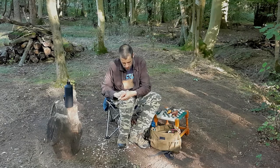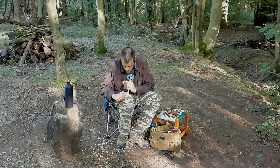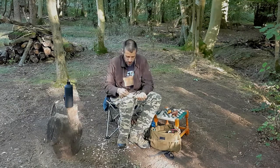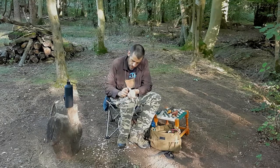The grain changes direction near the tip here for some reason, so I'm just going to come at that from the other end. There are lots of different ways we can do this but you've got to find what's right for the piece of timber you're working with. If it's come from a crooked billet, there are no real 100% rules I can give you about how it's going to behave, because each tree is different and each crook is different. Which is why they're such a good fun challenge to carve with.